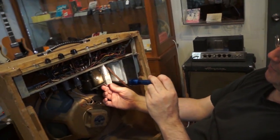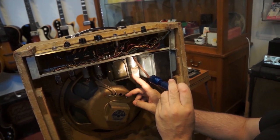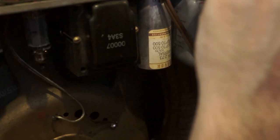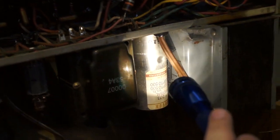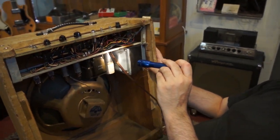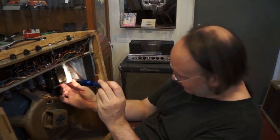This looks a little suspicious to me — usually manufacturers don't mount it with the stock label on it. So I wonder if when the transformer went, it took this out as well. It looks like a big filter — that looks like the main filter cap assembly to me. And the transformer might well have taken that out too. If it fried, it might have taken that out. This looks early seventies to me.